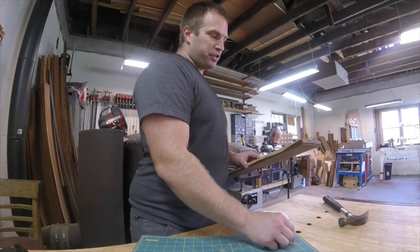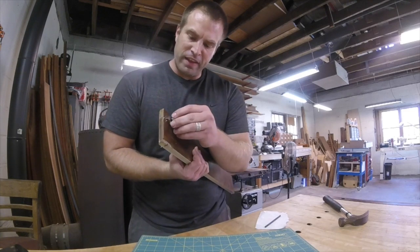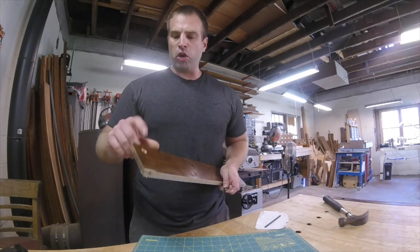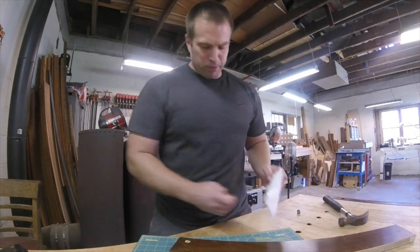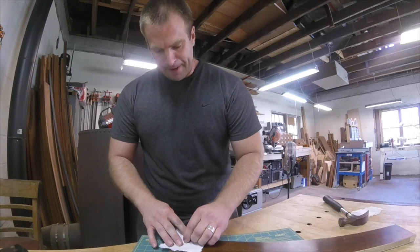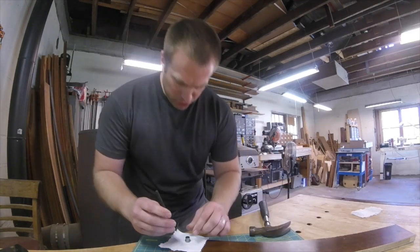The first thing you have to do is drill a hole in a board that will accommodate the outside of the cap finial to sit in there, but big enough so that the insert can be pressed out and fall into that cavity. So I drill the hole in this piece of wood to do just that. I typically put a little piece of paper towel over the hole just to protect the plating, the finish on the piece. Then I grab a punch — this is a center punch from my Harbor Freight set, a good ten dollar deal.